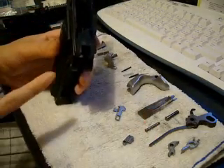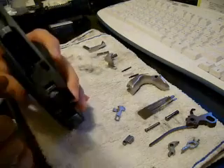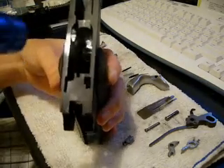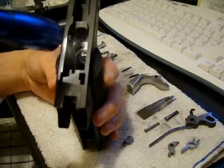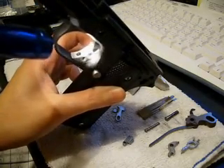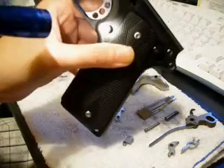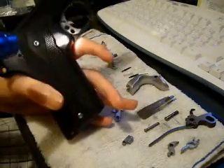I can show you what I worked on in this full metal frame to make the gun work. First of all, the trigger slot — I had to widen it by filing. The trigger is a little too fat for the slot, so I had to widen the slot right here to make it bigger for the trigger to move forward and backward smoothly. I also had to widen the mag catch hole a little to make the mag catch smooth — on both sides. Sand it down with fine grit sandpaper.